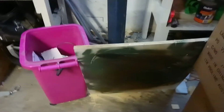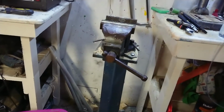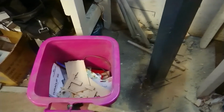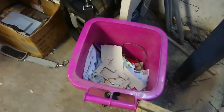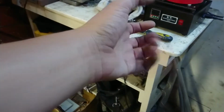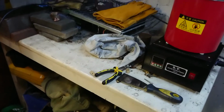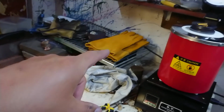I've taken my board here, which is my protection board. That's at the base of the pedestal where I will be pouring, and it's in a vise so there's a good grip on it. And that is, if you notice, taller than my shorts. So that's protecting the bare parts of my leg. I don't care if I melt holes in that. It's still better than melting holes in my legs. A whole lot cheaper at that. And I will be keeping my hands well out of the way. I'm probably going to put a long sleeve shirt on when I do this. Also be wearing the heavy gloves.